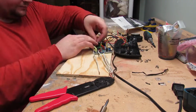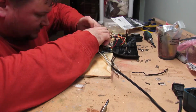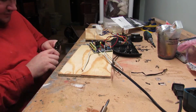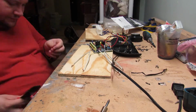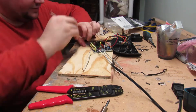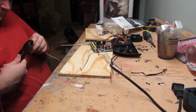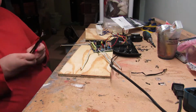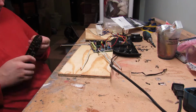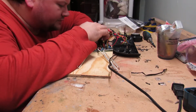But so in this case, I'm guessing this was either 14 or 16 gauge wire coming off of the UV PCB board. That's what it's called, that thing with all the electronic gizmos on it. And I had some spare 12 gauge house wire, so stuff that could take a bit of oomph in it without catching fire. So I just figured I'd got a new soldering iron and I'd go ahead and solder that all up together. And it works. And sadly, there's a bit of a time jump, unfortunately, just because the camera batteries went out.